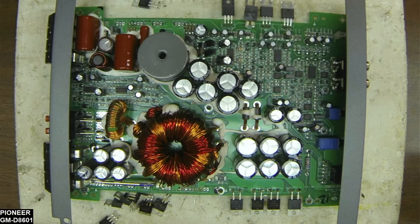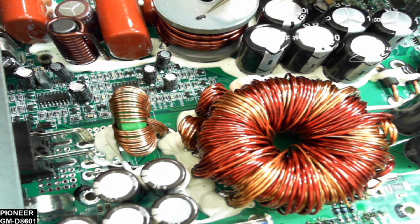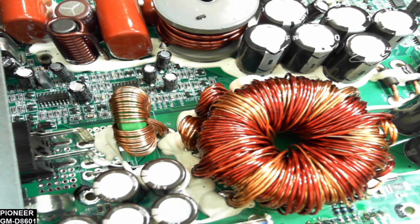I've returned. I've got the four IRFB4227s installed and the 3205s installed in the power supply. Now I'm getting ready to remove that burnt 2GM — I have the new one ready to go right here on top of the inductor. Let's get that old one off of there.